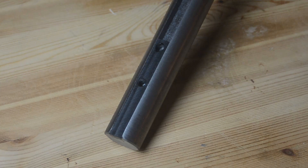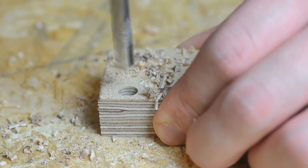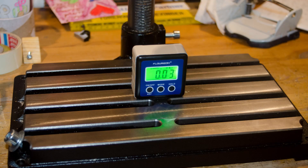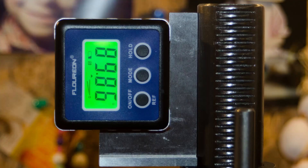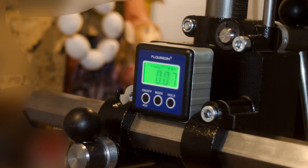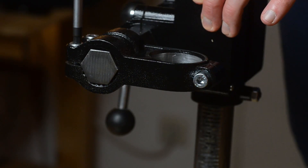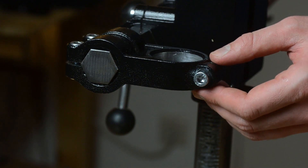But there is still a major issue: the accuracy of this drill stand. You would expect such a device to provide 90-degree angles or very close to it. I measured it and was surprised — even just visually it's recognizable. Every measurement relates to the surface of the base. You zero the base and then measure the side angles of the bar, the guide housing, the extension arm, and so on. What really stood out among the inaccuracies was the extension arm and its belongings — the housings and the machine carrier. The housing seems to have big inaccuracies and play, and the machine carrier definitely has play. It's close to invisible when tightened on the extension arm, but under pressure the angle can be manipulated.